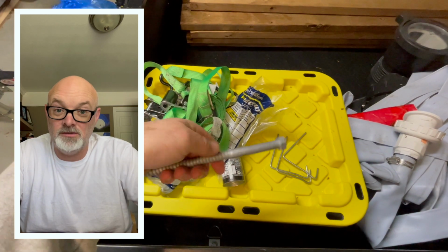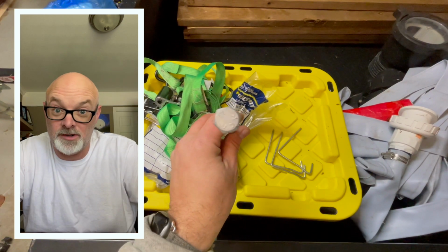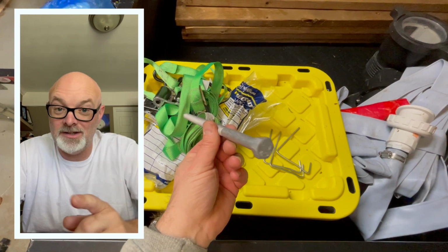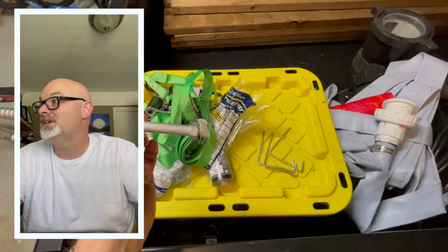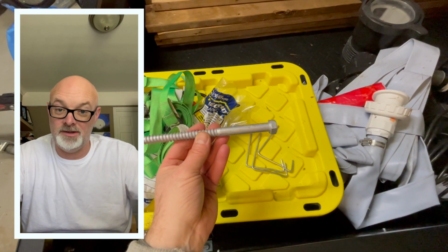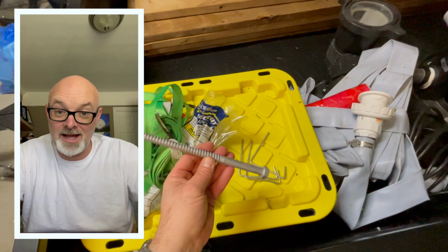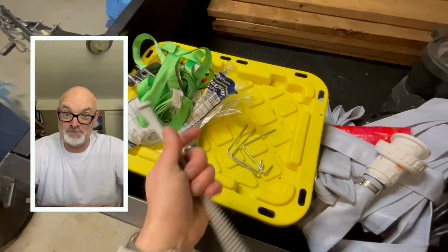So, just to correct you, on a most recent Google search, the lag bolts, or lag screws, is actually what you've got in your hand now. A lag screw can hold approximately 272 pounds per inch of thread if you're talking about pulling it vertically. And in terms of shear weight, let's check this other website. Lag screws are not tested for shear weight, but they're typically between 2,200 pounds based on the actual screw thread, up to 3,900 pounds for an unthreaded shank, okay? So let's just tell everybody to check with their manufacturer before they actually start using these things for construction purposes, okay? Pretty overkill. Anyway, I digress.